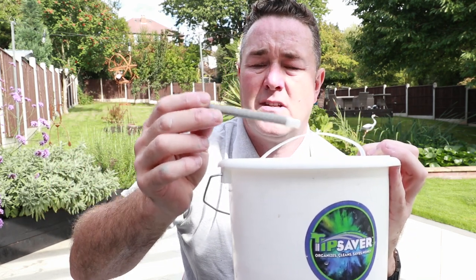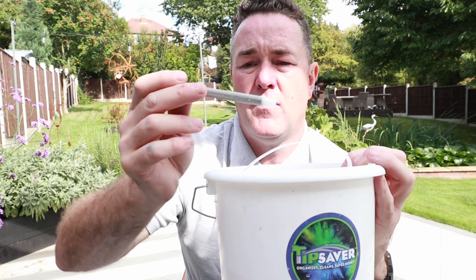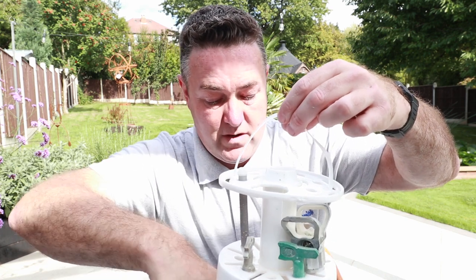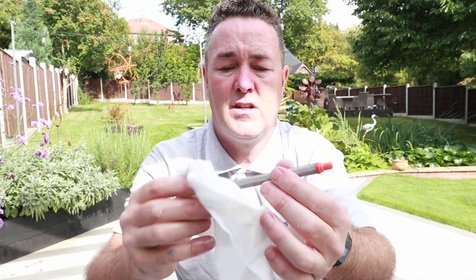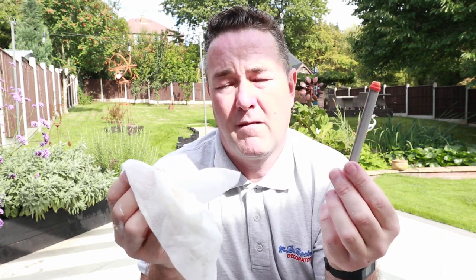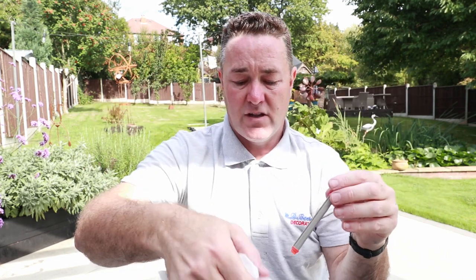The same principle works with gun filters. There's a white filter — you're spraying 516, 517 and above with a white filter. There are blue filters, and red filters that you use for fine finish on the Tritech spray guns — that's what I use when spraying woodwork: 206, 208, 210, 310. You go to about a 12 before you move on to the next filter, which would be yellow on the Tritech. This solution keeps all of those clean.